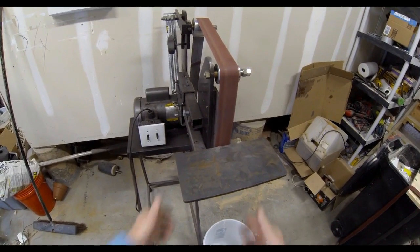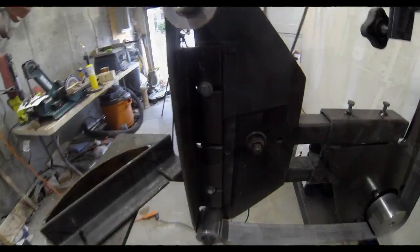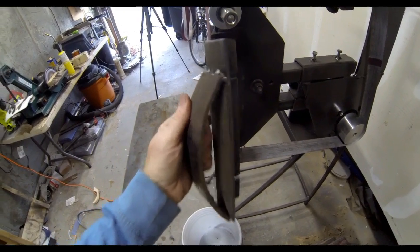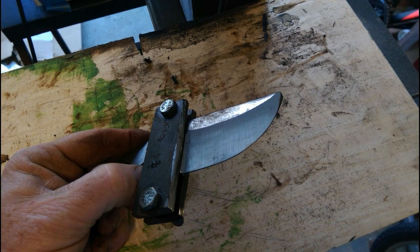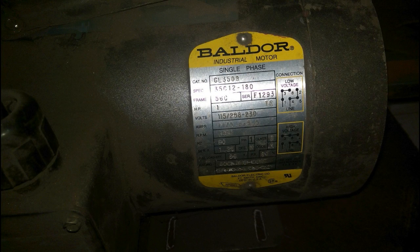I also made two mounts for the table — an upper mount and a lower mount — one of which is for the hollow grind. The platen was made out of two-inch angle iron. The hollow grind platen is just a curved piece of steel; I take off the original platen and put this one on. I've never seen anybody do it this way — most people buy big wheels — but the end results worked out really nicely. This is actually the first hollow grind I've ever done, done with that curved platen, so it's kind of a proof of concept.